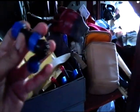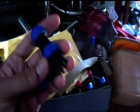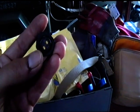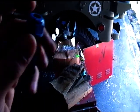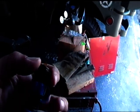Now, basically, the way I'm doing it, I will say I'm happy with. Now, you can't connect this connector together in any way other than one way round, so I can't mess up the positive and the negative to the spool gun and make the gun go backwards. That's a non-starter. So this connector needs to be replaced with the one that's on the existing spool gun, and I need to connect this socket here, which will unscrew.